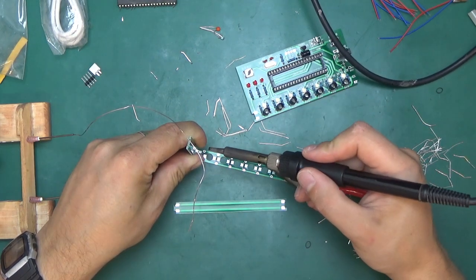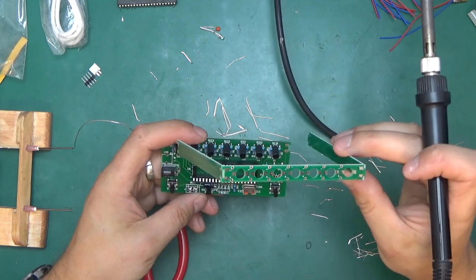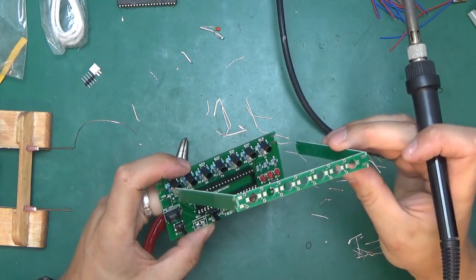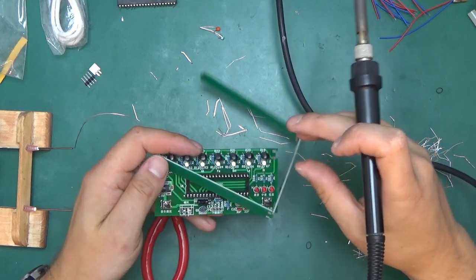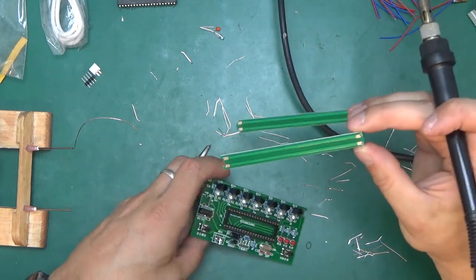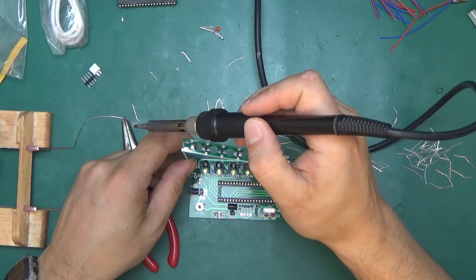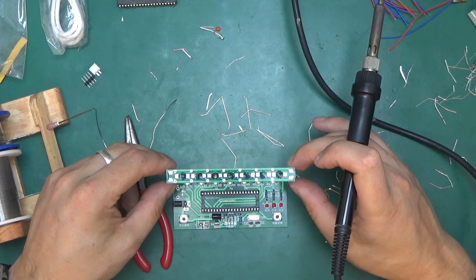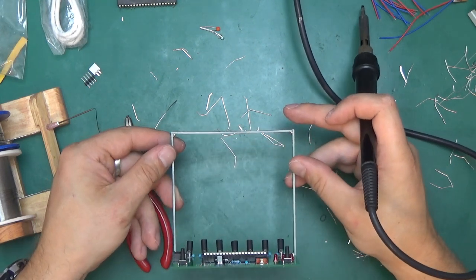Those tracks over here also supply power. We should mount it up like this. And are we doing it right? So this should be the positive. I guess it goes only one way, so we can't put it backwards. Clever. So one side is different to the other. Once we put it in place, we can reheat the solder joints and it will straighten itself up. It's an interesting way of using the PCB and solder joints as a mechanical construction material.